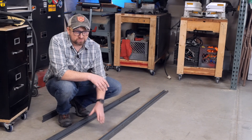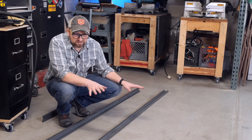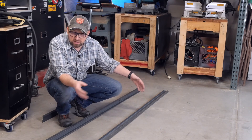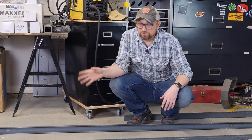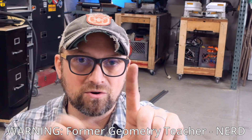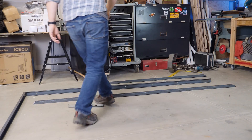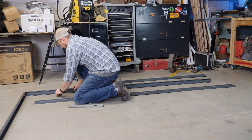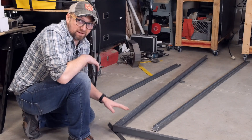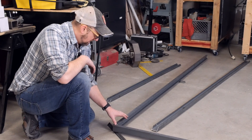If you're doing this on a garage floor, you need to isolate the material from it, because no matter how good the cement work is there are always going to be inconsistencies, and if you don't want your trailer to look like a taco this is the best way. Basically, we're isolating the frame pieces from the floor using geometry: if we support pieces in three different places that are not collinear — not in the same line — they create their own plane and will be square and true.